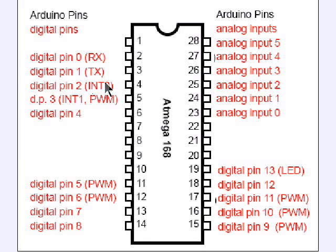One quick more thing to note over here, back in the upper left hand corner is digital pin 0 and digital pin 1, RX and TX, are used to communicate with the serial port on your computer. Those are usually not used for other things. So in reality, you really have 12 digital I/O pins for the most part. I don't like trying to use RX and TX for other stuff. It creates a headache. Notable too is digital pin 2 and 3 have programmable hardware interrupts.